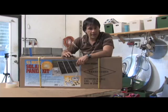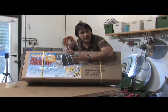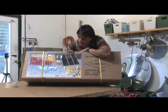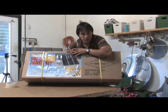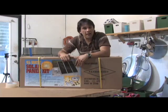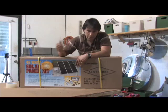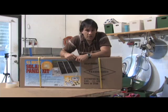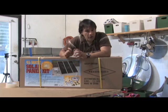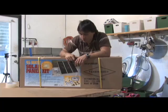These cells are a little bit less efficient, but they do have an advantage in that if something gets on them — like leaves, bird poop, or anything like that — these cells will continually work. A lot of the newer panels with multicrystalline, polycrystalline, or monocrystalline have diodes in them that prevent them from not working if one cell gets covered. With older systems, if one cell got covered, you would basically lose the whole chain.